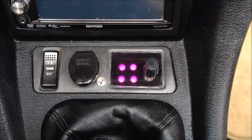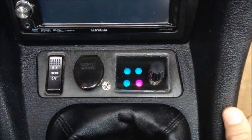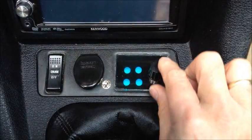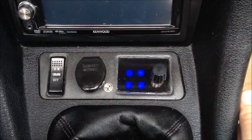If I want to go to medium mode, I simply turn the rotary dial to the next position to the right, and you can see it engage all the struts and move them to that position — to medium mode. To go to soft mode, one more click to the right and I'm now in soft mode on all four struts.